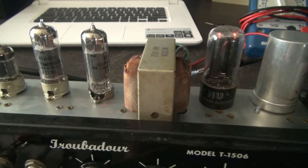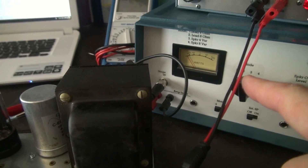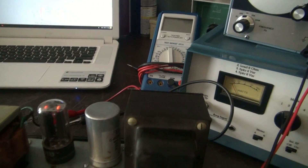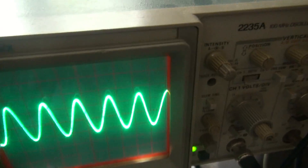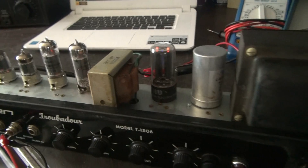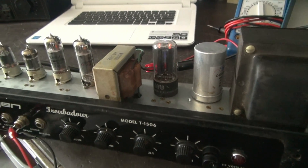New tubes are installed and I killed the lights so I can make sure all the filaments are on. All the tubes are nice and warm — looking good so far. Got the audio test set sitting here with the audio generator as an input. Let's bring up the volume. You can see we've got output on the watt meter. Let's take a look at the scope — there she is. So it looks like the tube placement was the problem. However, I did notice there are some capacitors underneath that need attention as well as that mangled wiring.